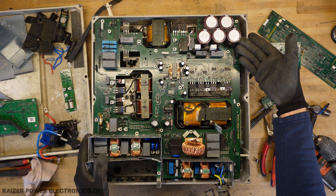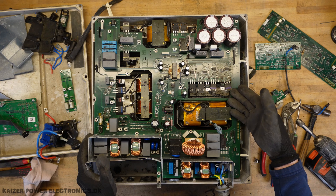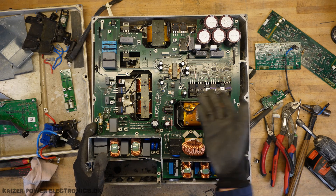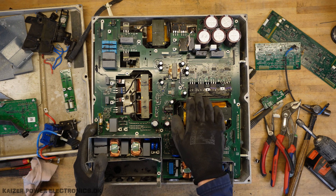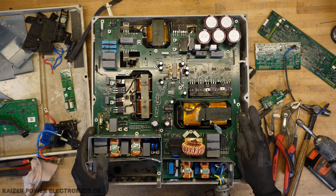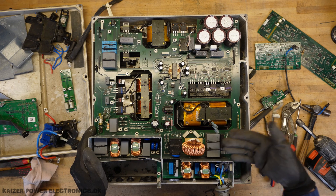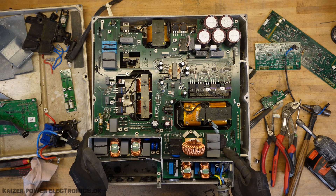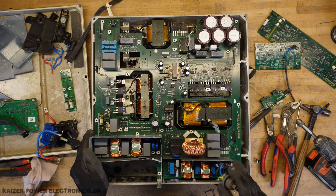The output inverter uses two different parts. On one side we have 6R07C6, most likely MOSFETs, and then we have a K75T120. So it seems we have some 600V parts and 1200V parts, which is a bit peculiar. We can also see on the driving electronics that this represents two different inverters, or at least two different layouts. We have a lot more capacitance on this side. On the output side there is more filtering, some relays, and what is probably a current transformer. There is also a large output inductor, the connector, and again filtering L and C on the mains connection.